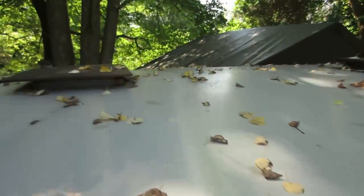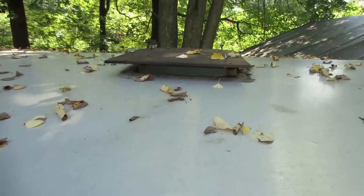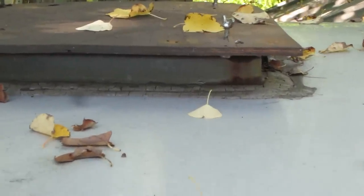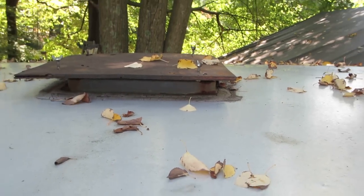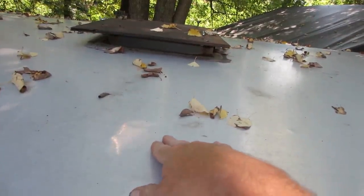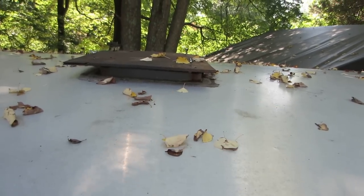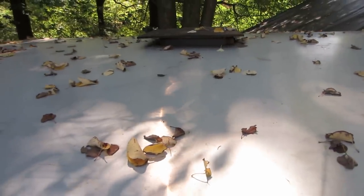Today's agenda is a skylight. They're pretty glued in, which would be expected. I've got to dig out where all the screws are to get them off. But before I do that, I've got to figure out a good way to get up here. The only thing between basically the inside and the outside is some real thin aluminum, and then there's a beam every 16 inches or so, so I've got to make up some kind of support so I don't go crushing through it.